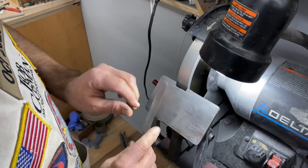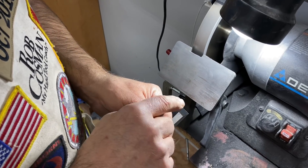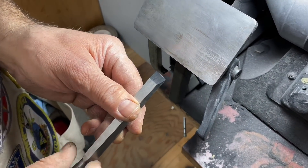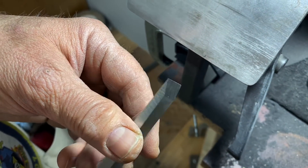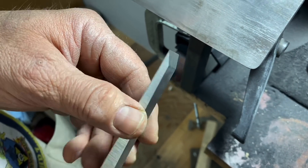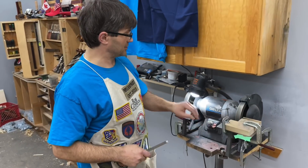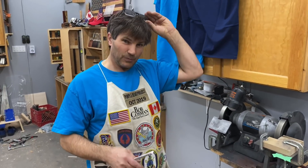From here I would take it over to the stones — I use ceramic — and I would create a secondary bevel on a 1000 grit, and then a tertiary bevel on the 16,000. The back still has to be lapped; you'll see the scratches. But that's how you repair. Plane blades, same way — square it off first and then just work to get it back to a point. Hope this helps. If you have questions, leave them in the comments below and we'll try to answer them. We'll try to do one of these each week. Don't forget to subscribe and push that bell so you know when we put out the next one. Have a good day.